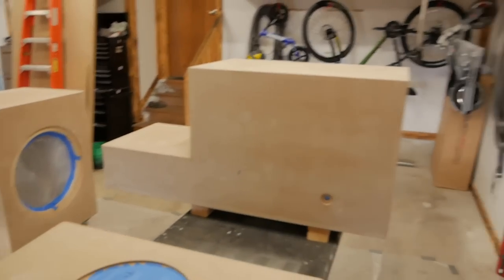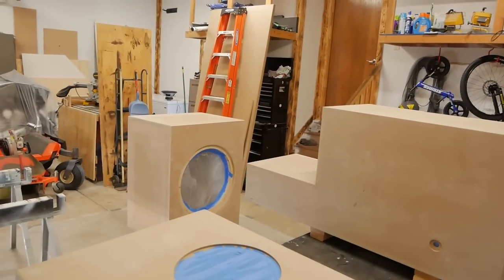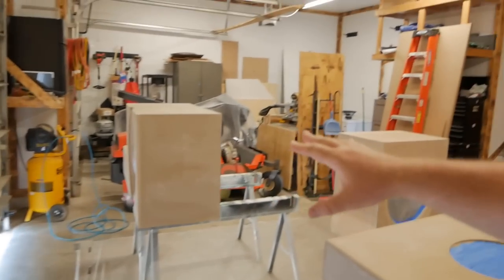If I had the choice, I would have something bigger, but I don't really have the room for that right now. If you're going to be doing a lot of spraying, it's always best to get something 30-gallon or above, just so you can keep up. With these boxes, with them being so large, I'll pretty much have to spray one entire box, let the compressor fill back up so it doesn't run out of air, and then go on from there.